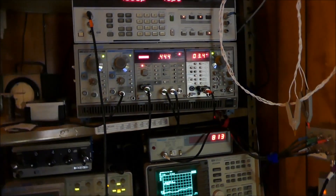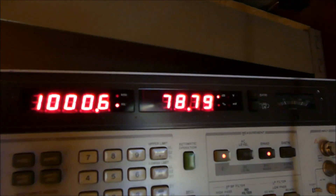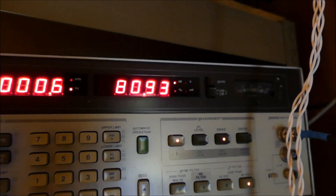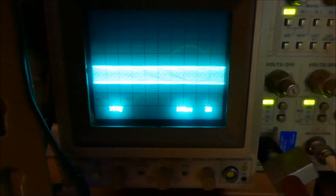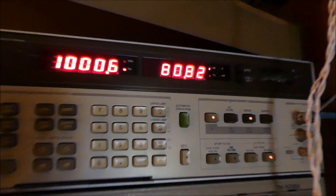We can't forget the signal-to-noise ratio of our driver. Here it is — it's almost 81 dB, about 80.9 something. That's 81 dB signal-to-noise. That's not bad. At a kilohertz, as you can see — the 1000 right there — as it comes on and off doing its thing. Signal-to-noise on the driver is okay. I'm happy with that. I have to turn the lights off. Those VR tubes are pretty cool, aren't they?